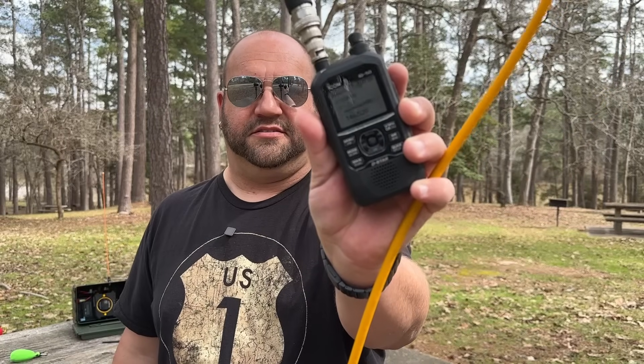Now let's see what this thing can do. I've got my ICOM ID-50 on high power, five watts, with just the stock rubber duck. I'm going to key up the Conroe Repeater 147.020, which per Repeater Book is 21.6 miles away from me. Doesn't even key it up. But now let's hook up the Faraday J-Pole. KV5SLX mobile — somebody's there. Full bars. Look at that.